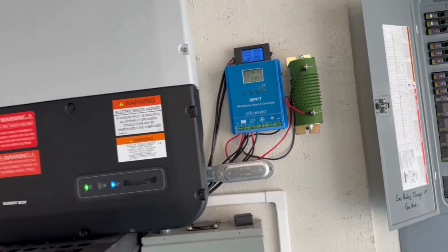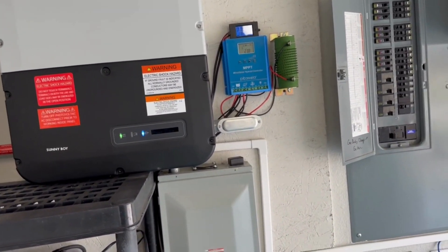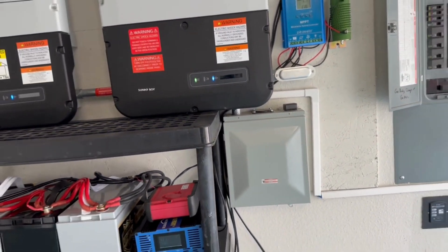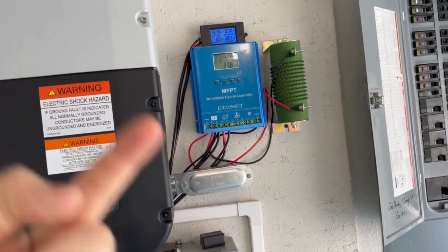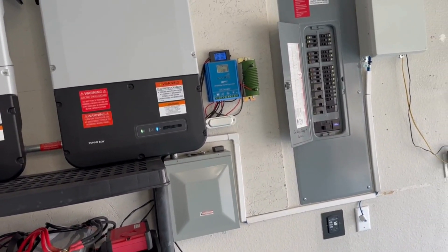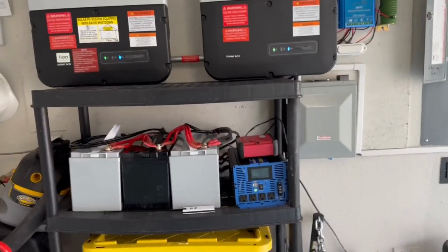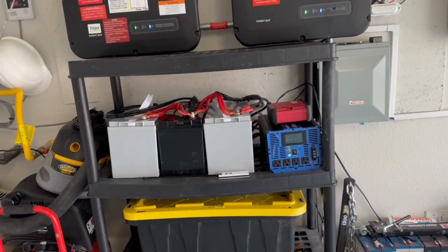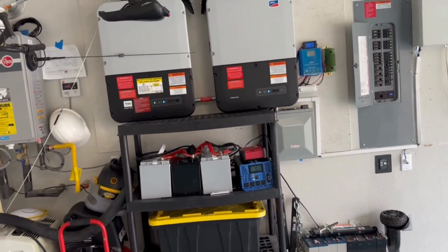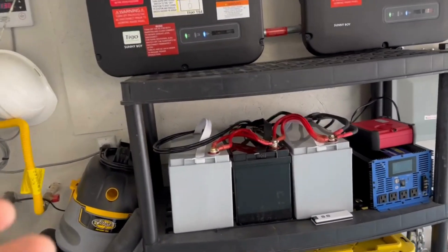To charge your system faster, you'll obviously need more solar panels. Right now I'm only getting about 80 watts on a gloomy day; on a sunny day probably 125 to 150 watts or a little more, but it's got to be direct sunlight. If you're facing west you get about seven hours of charge per day — seven times 100 watts is 700 watt-hours. So to fully charge the batteries from solar alone at this level, it'd take a few days. If you had more panels — say 800 watts total — seven hours times 800 gives you 5,600 watt-hours, enough to charge them up in about half a day.